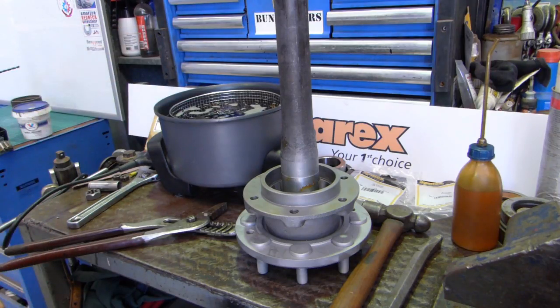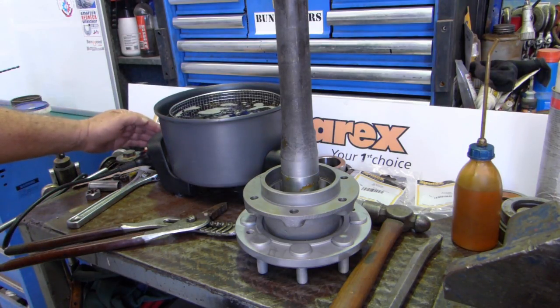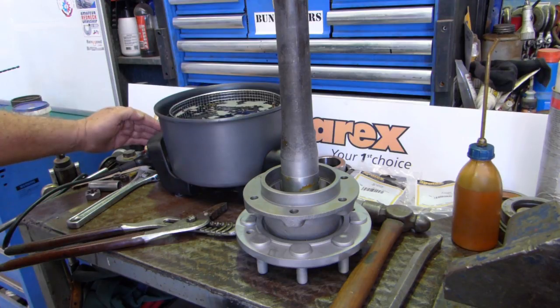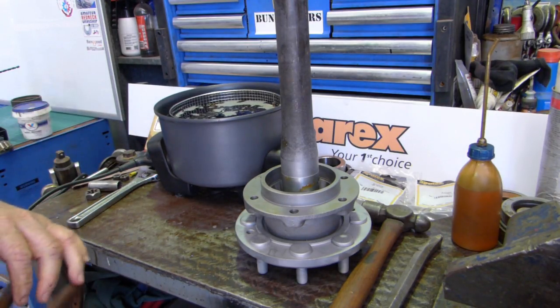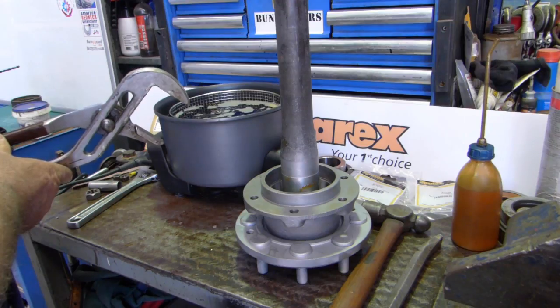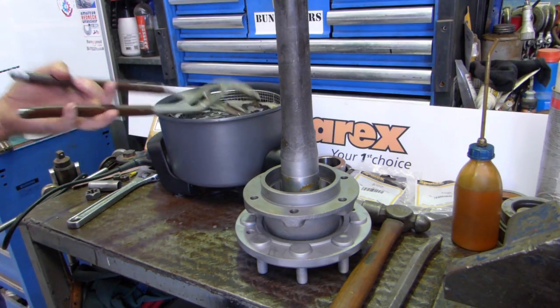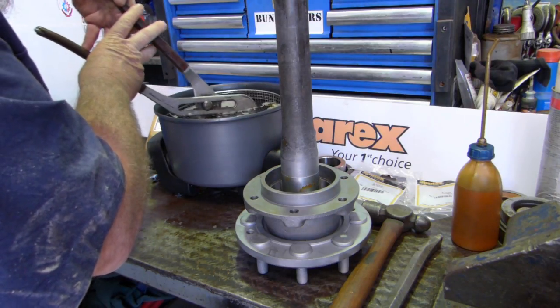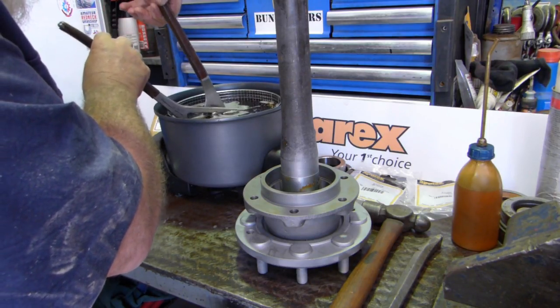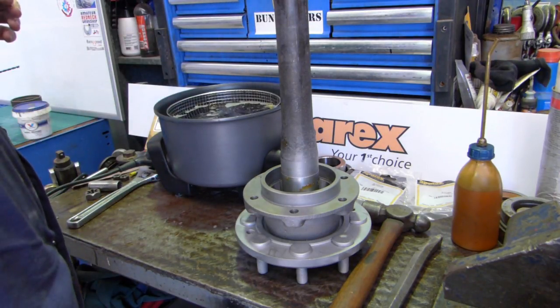Now you can see the oil moving around with its own heat. It's cycled a couple of times, the oil. I just got my hand over here so I can see the thermostat. Now the moment that thermostat clicks out, we know we're right at maximum temperature. That's when we grab the bearing and we get stuck into it. We have to do it quickly. The bearing does cool down very quick, so we have to be ready. Okay, it's there. Bring him up.